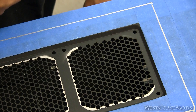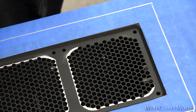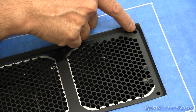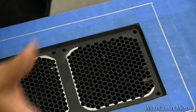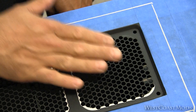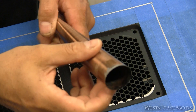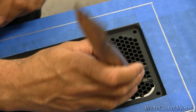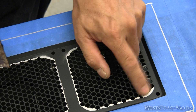The problem with doing 45-degree cuts is if I decide to run U-channel on there, U-channel doesn't work very well with a 45 cut. So I decided I could use a circle, but I wanted to stay far enough away from the hole as possible while still giving me a curvature there. Since this is recessed, I could have taken a coffee lid or something large for a wide radius, but it wouldn't sit flat. So I just took a piece of copper, made it oblong, and that worked out perfectly — I can line it up with the two existing holes and get a nice curvature there.